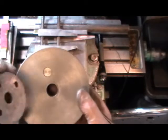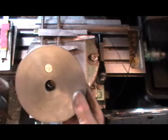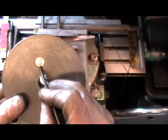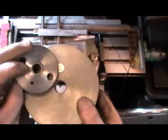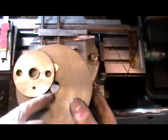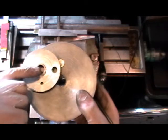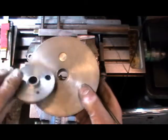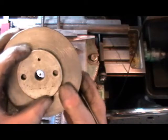So I've come up with a solution — I've just made this simple jig. I've got my distance from my centre to where I want to drill the hole, halfway in the cast iron and halfway in the 316 stainless. I've made this little jig. It's got a diameter to fit in my axle hole, then I've marked off at a radius where I want to drill and drilled my 5/32" hole, and then I just put this jig into the hole in my wheel.